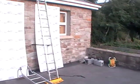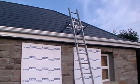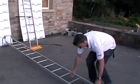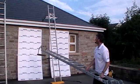Now if we look at the roof, I'm going to demonstrate it on here. This is quite a short roof, so we don't need a 20-foot ladder for this, but we still can use it. So what we do is we simply pick up the ladder at this point and we're simply going to roll it into position. For this particular roof, I'll probably be able to get this roof ladder fully into position from the ground.